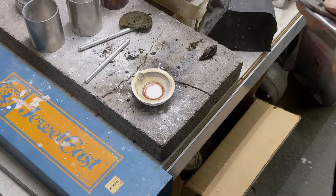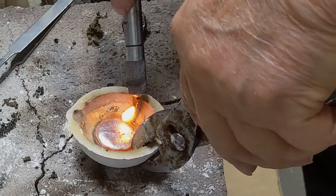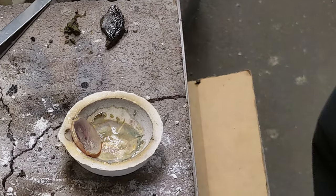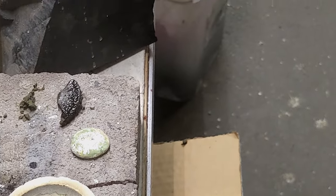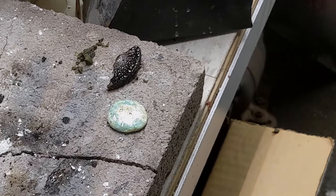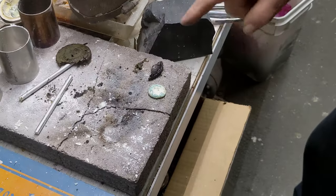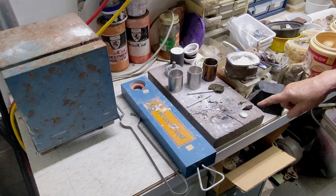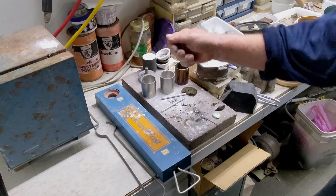I'll probably do it like I did before. There we go — it's loose. What's burning is the wax on here. Now we got our slug. That's a great piece of silver. You see the greenish tint to it? That's the borax flux and all that was in that cup. I like to see that coating there so that when we melt it again, that will help it roll again. Once it's melted into a ball and rolling, that's when we pull this and pull the vacuum.